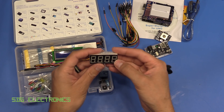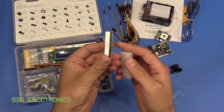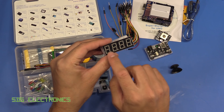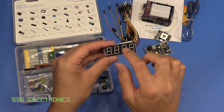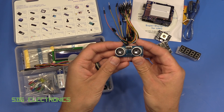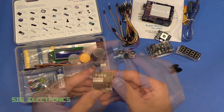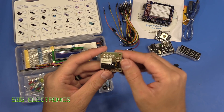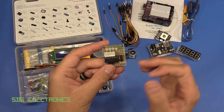We've got a seven segment display and this is the multiplexed type, so you've not got a huge number of pins - you've just got a common for each digit and then the seven pins for each segment plus the decimal point. We've got an ultrasonic transmitter and an ultrasonic receiver, which is quite cool. It looks like it's already got the chipset on the back. Then we've got a little board here with the ULN2003A on it and four LEDs, and I think this is basically designed for driving a stepper motor.